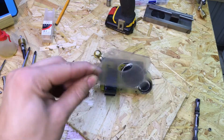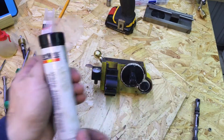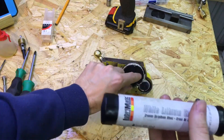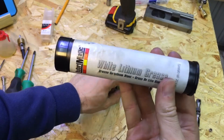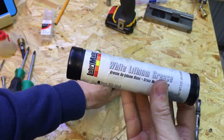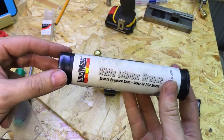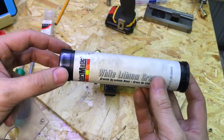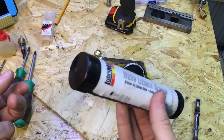The cover is cut out and it fits well on the gears. I've put some white lithium grease on here — it's a marine grade and I've been using it on the lathe since I bought it, which is about five or six years now, with no problems. I also use it on the plastic change gears as it doesn't react with plastic. It was quite expensive — over ten pounds — but it was the only one I could find that was compatible with plastic, and I haven't had any wear on the plastic change gears, so it must be fine.